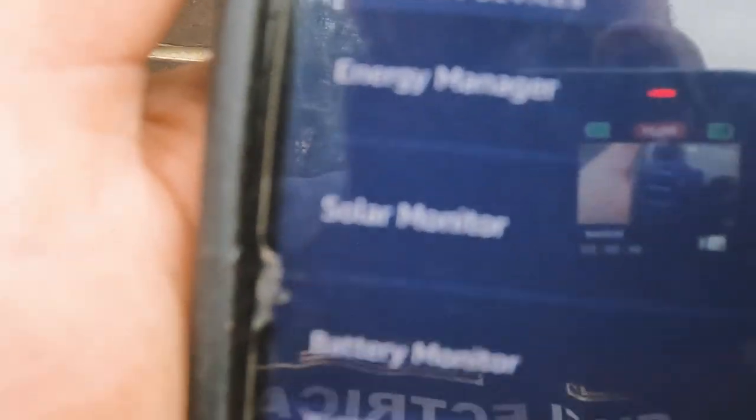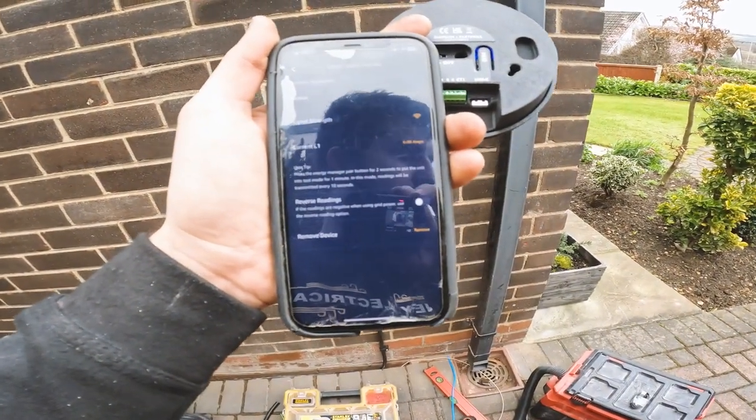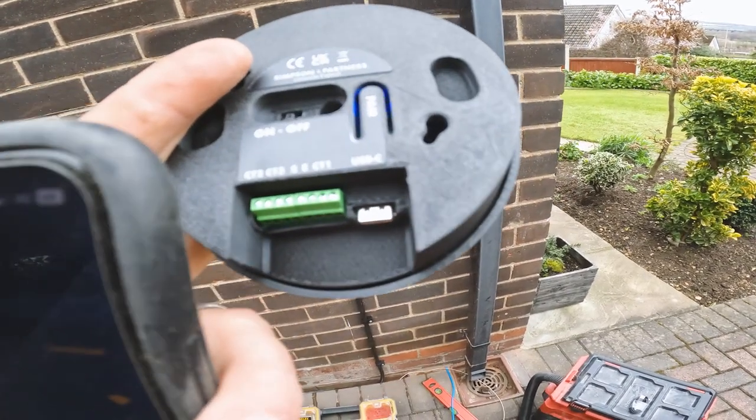It's all powered up now, so we're going to the app. We've just found that charger through Bluetooth — click on that and it comes up with all the details about it. Nice and easy. Here we're going to set up the wireless system. We've put it onto on mode, and it's a wireless device for the energy manager. We click pair — there we go, it's popped up for the energy manager. We click add, and that's added. Nice and easy. That should work when we connect the CT into CT1 and put it around the main tails coming in to sense the site's load.